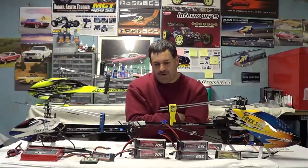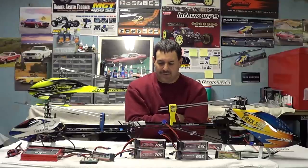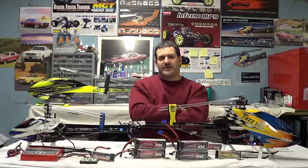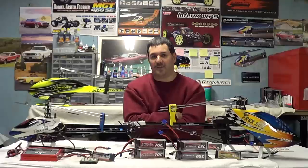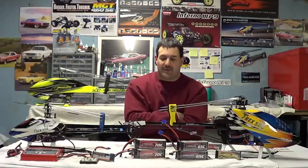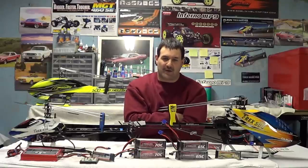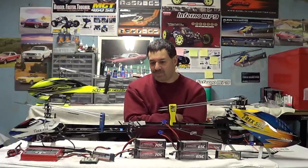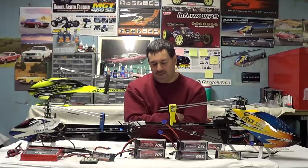I've never had one puff up, never had one burn up on me. With other batteries I'd charge them and get one cell at 4.20 and another at 4.10 and have to put it back on low amperage to try to fix the balance. I went through that with the Echo Power batteries — it was a real pain to balance the cells. With Thunder Power batteries I've never had to deal with that.